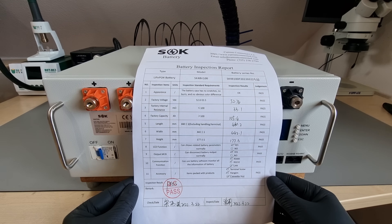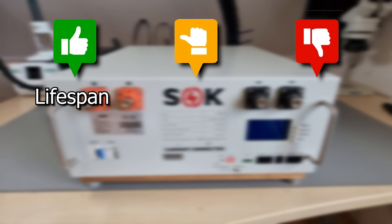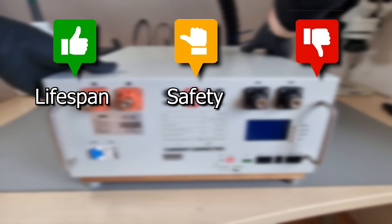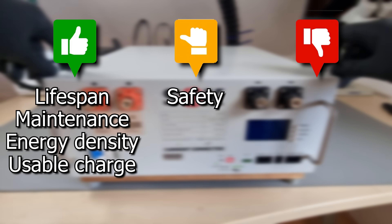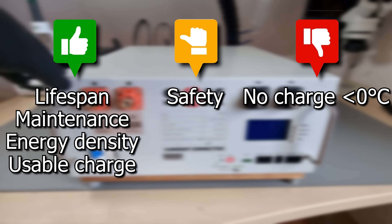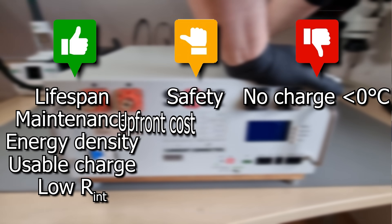I've mentioned these before, but because I'm still getting outraged comments about lithium iron phosphate prices, here are some of the advantages again. These guys can have an insane lifespan depending on how hard and at what temperatures they are used — still at least 80% of their initial capacity after 4 to 8000 cycles. If one doesn't go through a complete cycle every day, these can last for tens of years. They aren't as safe as lead batteries but much safer than NMC lithium ions because their typical cell voltage is much further away from the electrolyte breakdown voltage. They are maintenance free and have much better energy density per weight and volume than older battery technologies. You can use all of the specified ampere hours and not just half of them as is common with lead acid types. The only disadvantage is that they must not be charged below freezing temperatures, because that's where lithium ions cannot travel as easily and permanent damage can occur. Still, at the moment this is the most desirable battery technology for solar power storage — prices are pretty high but worth it.